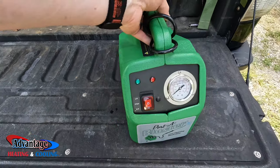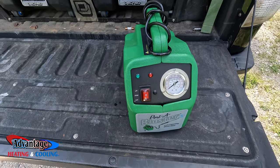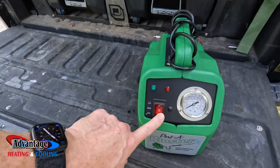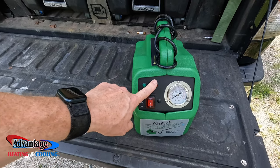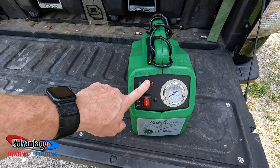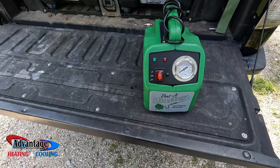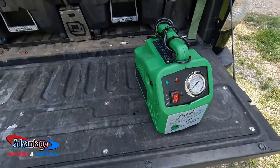All in all, this is a good setup for cleaning condensers outside when you don't have much water pressure — you can fill up one of these buckets. It's ideal for that because you've got the high pressure setting. It would probably also be good for cleaning an actual A-coil or N-coil in a furnace, where you've got sheet metal around it and it's not going to get crazy with drywall or paint — that's what I was finding when using this on the mini split.